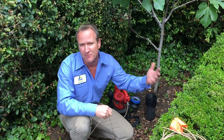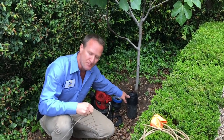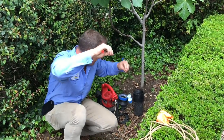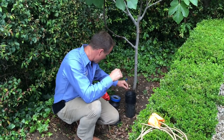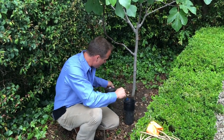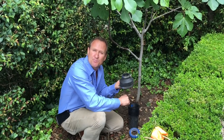Now that everything's capped up on the roof, what you want to do is find your main sewer clean-out — that's typically in the front or the back. We've removed the clean-out cap and we're going to utilize two smokers, attaching them to flexible wires in order to drop them down into the sewer clean-out. Then we're going to use our garden blower, which is two inches in diameter, along with a rubber coupling to allow us to seal it properly.